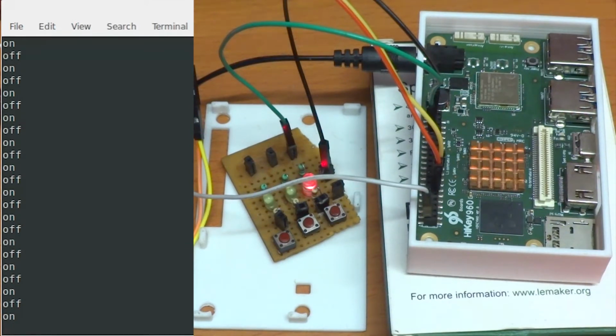Now if you go ahead and create a project, I would recommend using a mezzanine board that would allow you to switch between 5 volts, 3.3 volts and 1.8 volt GPIO voltage outputs, so you can work on that. And that actually makes things very easy. 1.8 volts, you won't find many devices that work directly off of it.